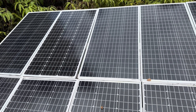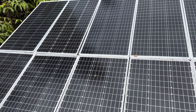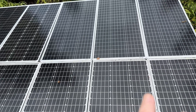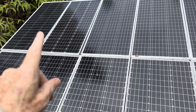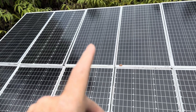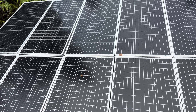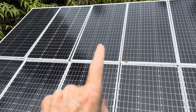Here on this rigid array, this 1,000 watts is powering that 600-amp-hour bank of Chins batteries. It's been getting up to a full charge every day for the past month, so I wasn't looking at it that closely — just making the rounds making sure everything looked good on the gas gauge. But yesterday I looked much closer and realized there was a real difference between my top string and my bottom string, which each go into a separate charge controller. The top string was fully 100 watts off of what it should be. What I found was a dead panel — that one right there. That's the third panel in the past three years that I've had fail.